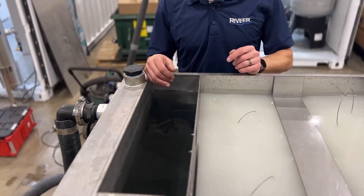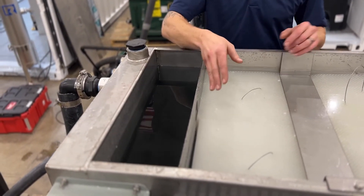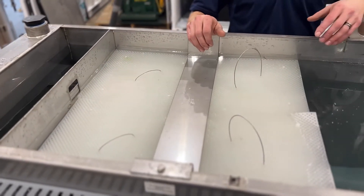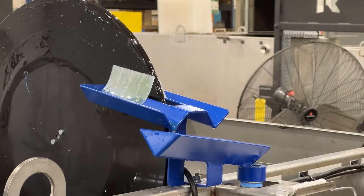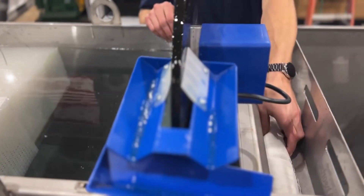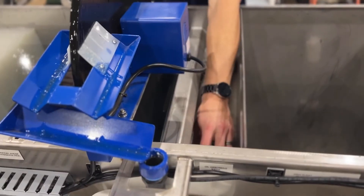This is the oil-water separator's first chamber, where the process water is forced through the cube packs which grab oil. The process then goes to the oil skimmer which grabs the most amount of oil out of the system, going into the oil sock which grabs any residual oil that's left.